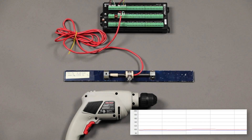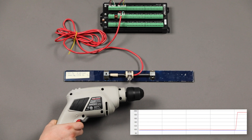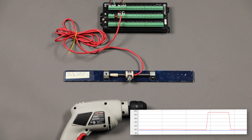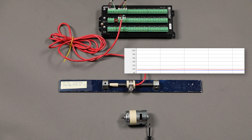We are going to spin a drill to create AC electrical noise. The graph shows a blue line for the sensor signal as measured by V-Spec and a red line for the sensor signal as measured by the time domain method. As I engage this drill, you will see the red line move. Nothing is adding strain to that strain gauge — that jump in the red line is caused by the electrical noise from the drill. The blue line stays steady, showing that V-Spec was able to filter out the electrical noise.